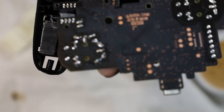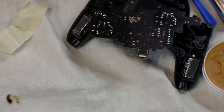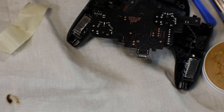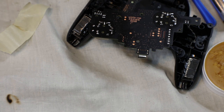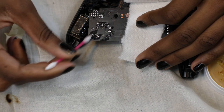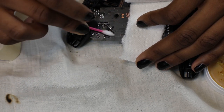If you think I did something wrong or have any tips or advice, please leave them in the comments below — I would love to learn and get better at this. Now I'm taking alcohol on some paper towels and wiping all of the burnt flux left over on the motherboard, and using a Q-tip to go in between the pins and get those parts as well.